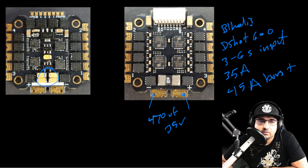It should do just fine for a basic setup — 2300 to 2400 KV even on 6S — unless you're building something that pulls a lot of amperage. For a DJI cinematic or freestyle setup I think it'll be totally fine. The ESC uses BB2 chips, so again DShot600 maximum. The motor output pads are nicely sized and well spaced. I do wish they had utilized the board space for more filtration though.